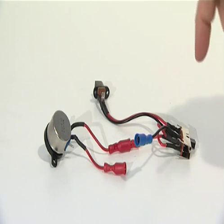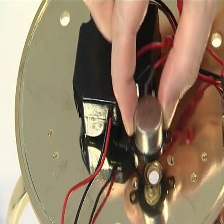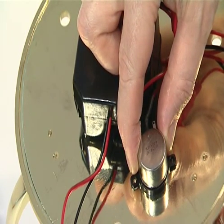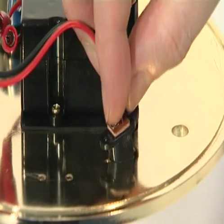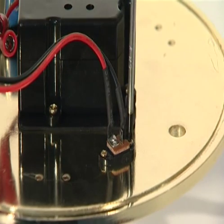The three elements are: the speed controller, the on-off reverse switch, and the power inlet socket. Fix the speed controller so that the wires project towards the gearbox. Secure it with two PM3 screws, making sure the spindle for the knob goes through the base plate. Fix the power inlet socket with two tiny PM2 screws.